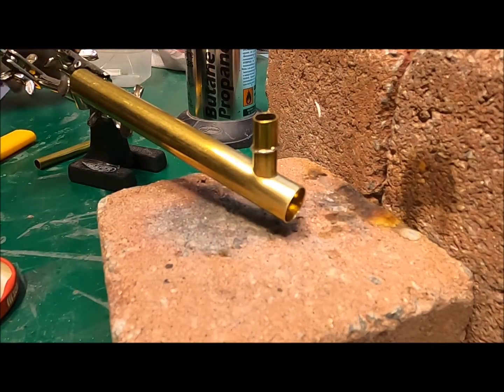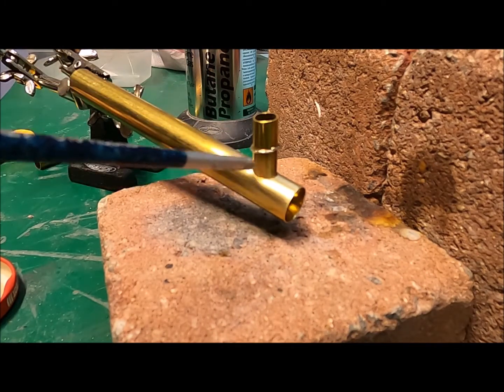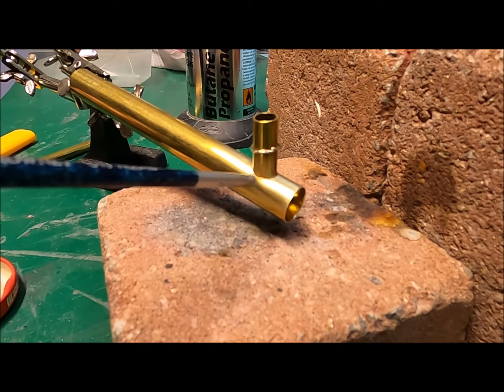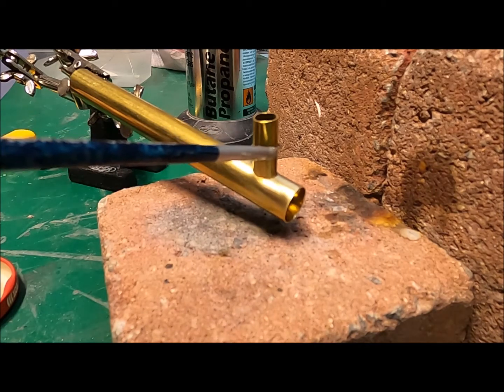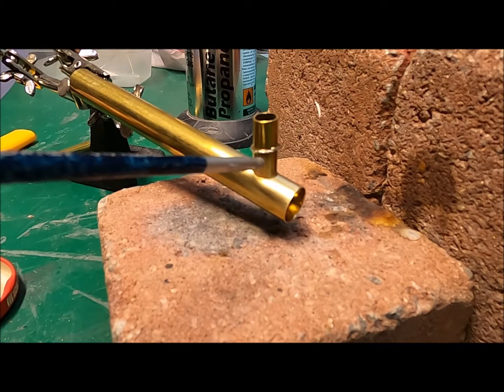You can see here I've got my two pieces of K&S thin-walled brass tube. I've made a hole in the larger section, then added this pipe and gradually opened up the hole so that it was a snug fit. That's ready to go, all cleaned. There's a small ring of silver solder that I've just bent around a piece of pipe, and that's ready to go.